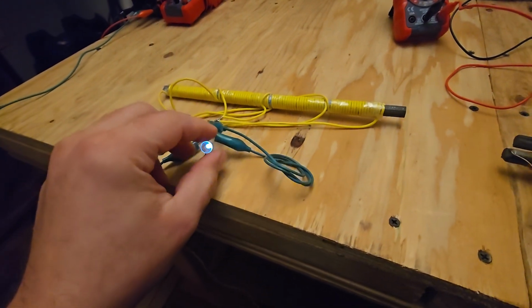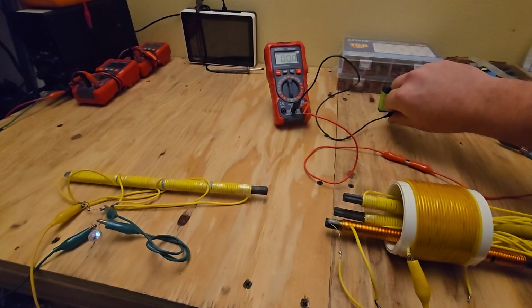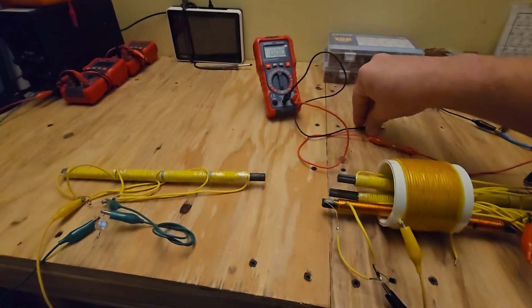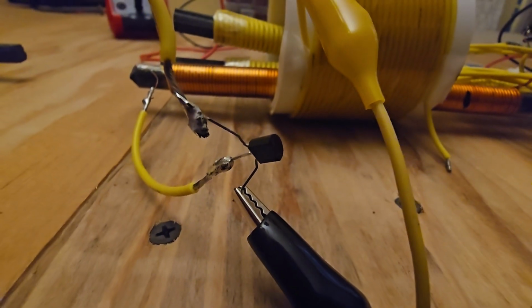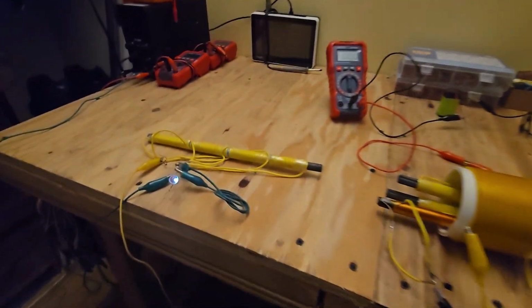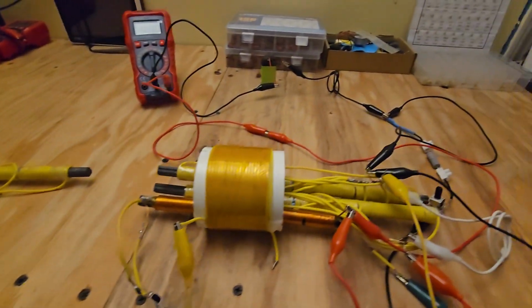And we know that this thing is doing it because when I disconnect the battery, the light goes out. So the battery is just providing the voltage to trigger the transistor. And the transistor is a much more energy efficient BC547C now. I'm going to have to clean that up and make it even tinier. So we have a much more energy efficient transistor.